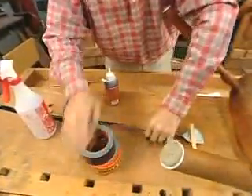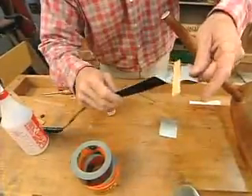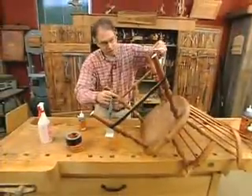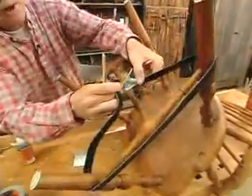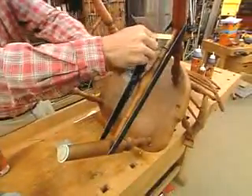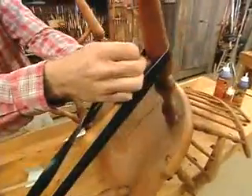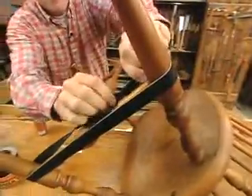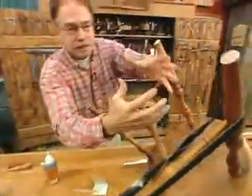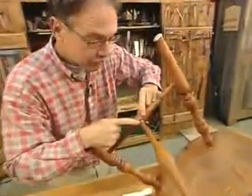Gorilla tape — I've doubled it up on itself except at each end. Use a piece of scrap wood there to keep that tape from folding back on itself. I bring it up and draw it tight, then take the scrap wood off. This is the best version of a web clamp going. Web clamps are expensive — it's just a web of cloth with a crank on it. That stops the leg from spreading when that glue cures, and the glue expands out to get a good solid joint in a captive joint like that.